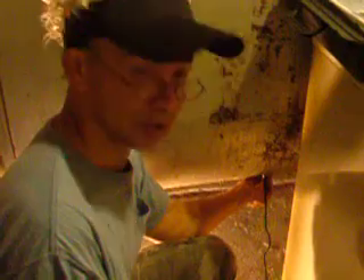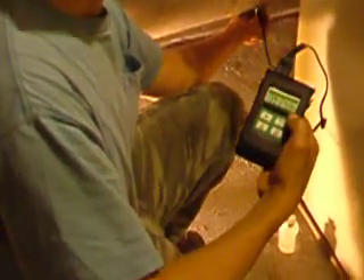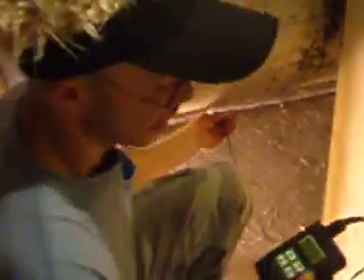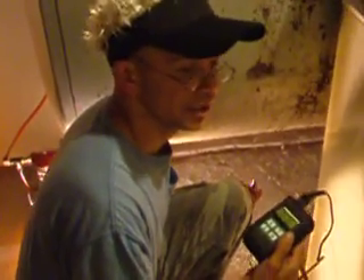Put another gel on the tip and you keep checking it. Again, you look at the meter over here — bring the camera close, you see over here: 0.182. You do that all the way across the tank. On the bottom you go all the way across. The lowest number is going to tell the technician where the tank is weak.